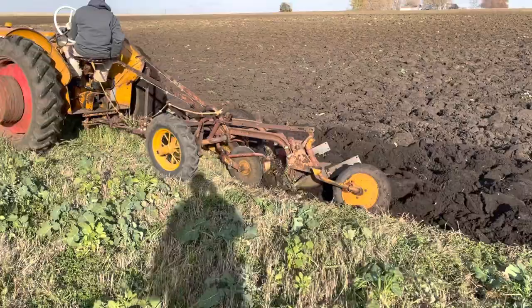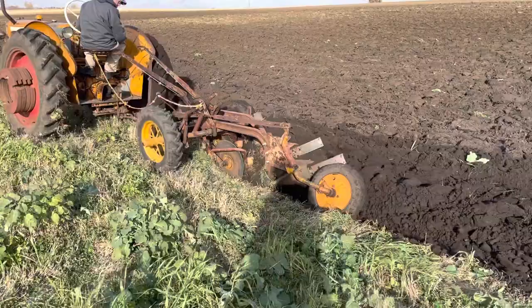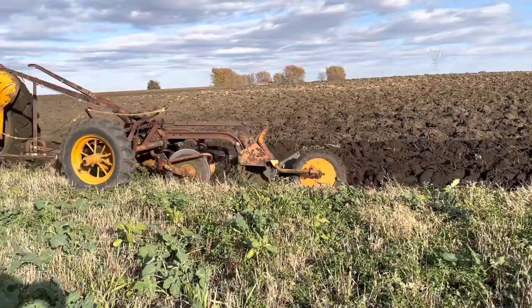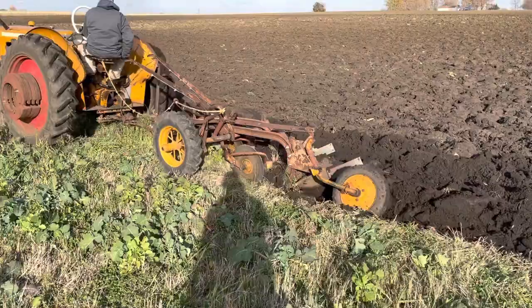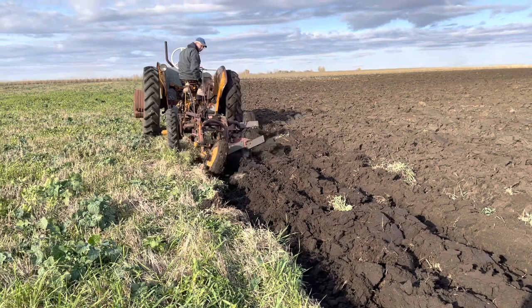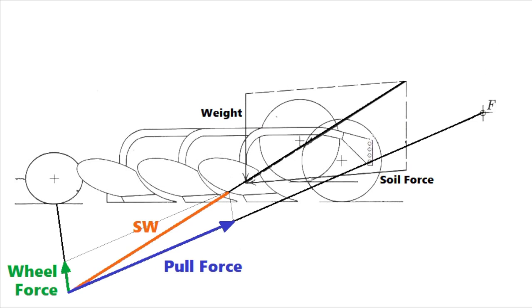Out in the field with a plow drawbar that is too flat — this turned out more subtle than hoped because the shares are very sharp, which makes you look a little harder. You can see the tail wheel and tail wheel linkage flopping around because there's no consistent force on the tail wheel. Then the back of the plow is not planted in the ground, so the landsides can't support it and the plow kicks over toward the unplowed ground.